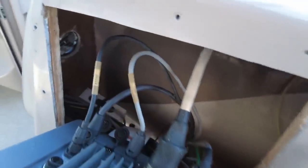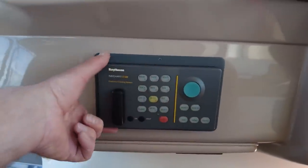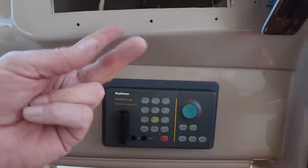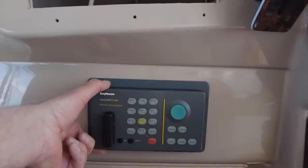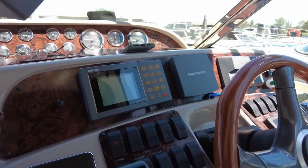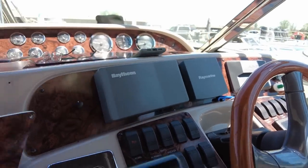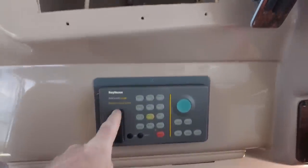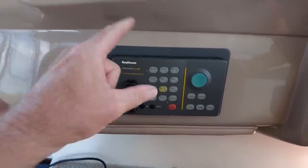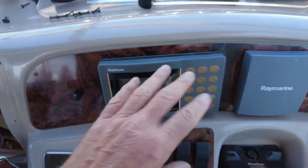You can see the radio, labeled everything — radar, NMEA, and other stuff — so this is all going to go. I'm going to disconnect it right now and make sure those wires are not left powered behind the dash. I'm also going to take out this unit here which has some sort of screen. It turns out it's a GPS/LORAN unit, but the LORAN antenna is already gone so it's never going to do anything. I want to disconnect it, get it out, and make sure there are no live wires floating around back there.